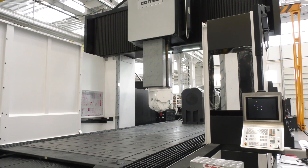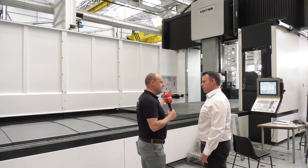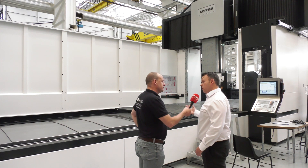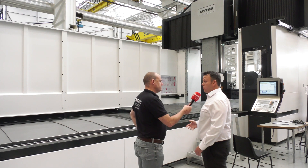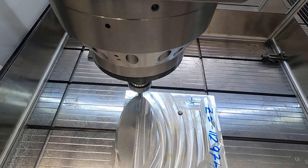What about the actual movement of this table — moving backwards and forwards — because I always think about wear and speed and that sort of stuff. On a Fox machine in the X-axis it is a double rack and pinion motor, so not a ball screw, meaning there's no deflection or bend. It is very, very accurate, gives longer longevity to the machine, and you don't need to use scales for it.